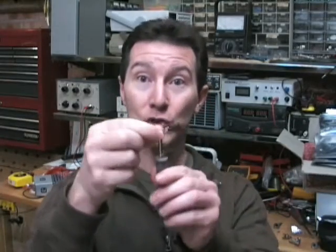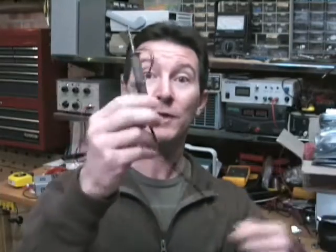This has nothing to do with it. You can pick it up with just a coax, as I demonstrated, or just the probe, or the probe shorted right at the tip — a proper RF short with some alfoil. I've seen this phenomenon not only in my own lab, but in all sorts of other labs over the years and all sorts of different types of oscilloscopes, and also different types of probes. But people don't want to take my word for it. They want some more tests. They want me to use a real oscilloscope and a real known probe under better conditions.